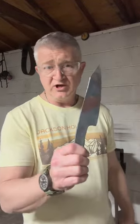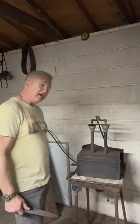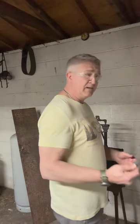the real purpose of this video is to talk about how not to waste your money and to work efficiently. Anytime you turn the forge on, it's a propane forge, so you've got to pay for the propane. So let's make certain that we're maximizing the heating of the steel. So rather than just come in here and turn the forge on and pound this out, and then another time, turn the forge on and pound this out, what I do is I take this steel, since it's bigger, and I get it in the forge first, let it get hot up to temperature.